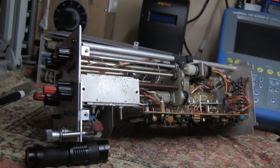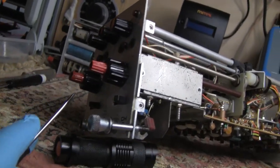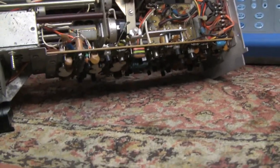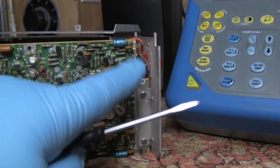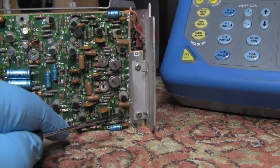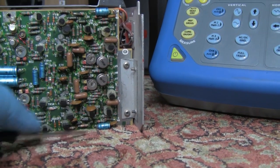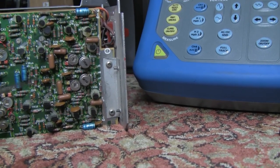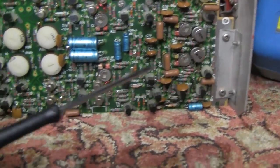We're getting into the balance of it now. This is the two-channel amp module taken out of the chassis. Originally I was focused down around the preamps and couldn't really find anything seriously amiss on this side. Started scoping it up and couldn't find any signals anywhere — just static DC volts — so I followed the circuit all the way back.